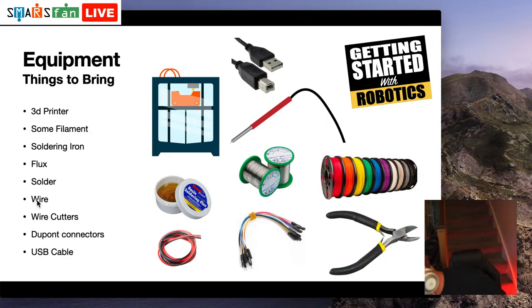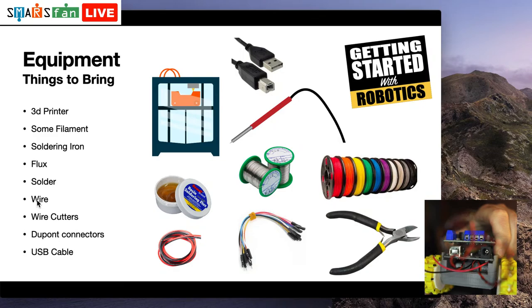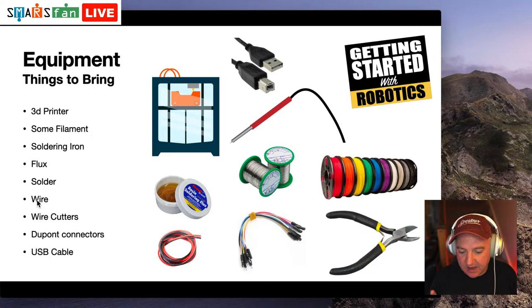I wouldn't recommend, unless you want to spend a lot of money on the crimping tool, don't be tempted to buy a cheap crimping tool for DuPont connectors, because it's kind of a wasted investment. You'll never get them as good as the bought ones that have been made in a factory by a purpose-built machine, unless you're willing to spend probably over $100 on the actual crimping tool. So I made a mistake of doing that. It's not worth it. So that's the DuPont connectors, and you'll need a USB cable as well to plug into the Arduino, just that little connector there. So whatever end you need to plug in. So I'm using a Mac Pro, and that's all USB-C.